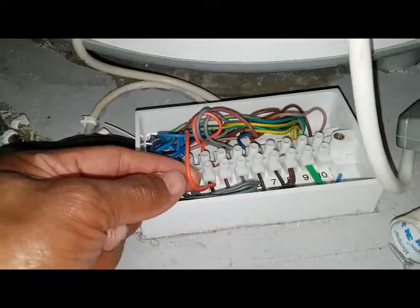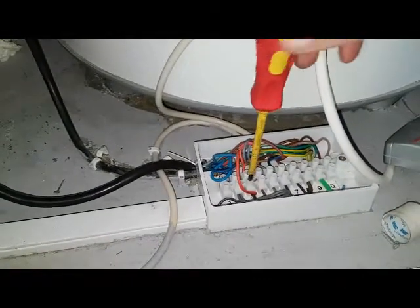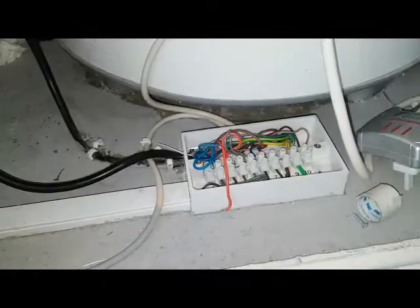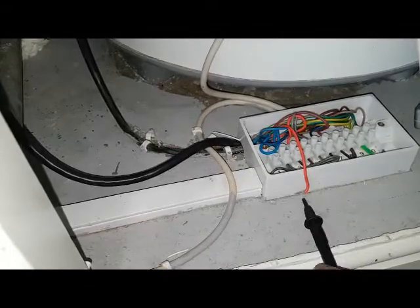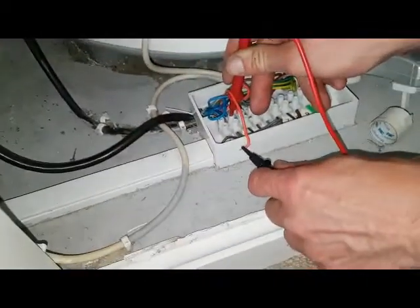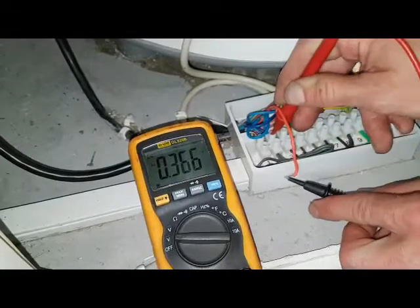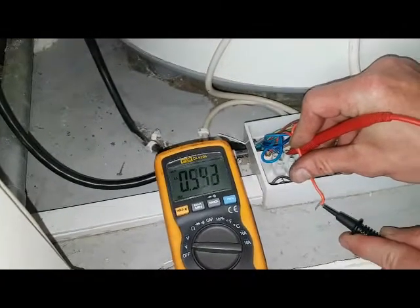This wire here is for the Drayton one. We're going to undo this connection with the power turned off, pull that orange wire out, and then test across the blue neutral and the end of the orange using the multimeter to see if we get 240 volts. So with the black probe on the neutral and the probe on the end of the orange wire — the reading is just 0.43 volts, so there's nothing coming through with the power off.